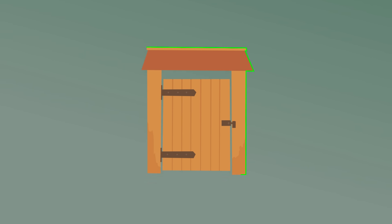If you're going to be building a fence brand new, know that this is a common issue so that you'll either take your time and set that corner post properly, or you can go ahead and install a header at the very beginning before it ever has a chance to lean.